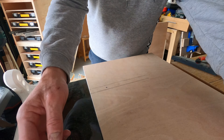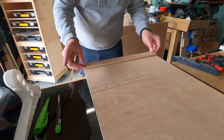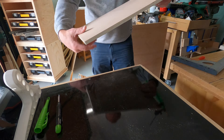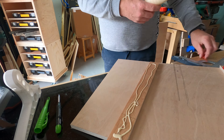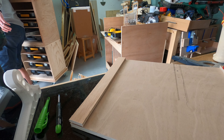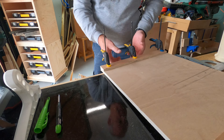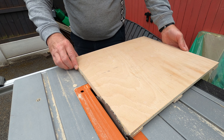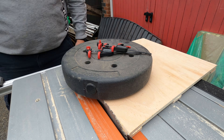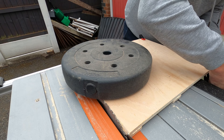The next stage was just to glue it up, which I did, and I clamped it together. What I did first was put glue on the one that had the strip on it and let the glue go slightly tacky before attaching it, then I spread loads of glue out with my best glue spreader in the garage workshop. The wood was quite bowed there so I just flattened it out with the clamps when gluing. I went for a very low-tech approach where I literally levelled it up, put it on and flattened it out.